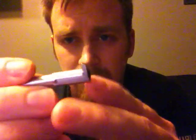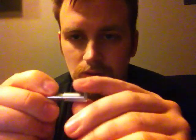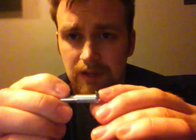And basically what you're going to do is lay your stone, put your striker down on top of the stone, and push it, trying to maintain the same angle as what you have here. So you want to keep the pitch about the same and not reduce it. If your pitch is like this, you want to angle your striker on the stone so that it's flush, and over time you're going to shave this down.